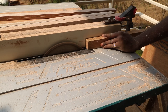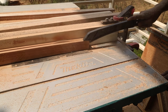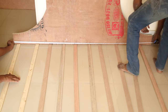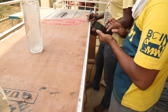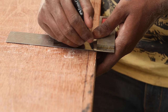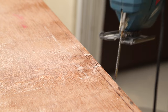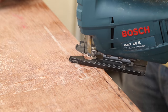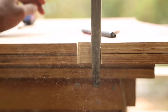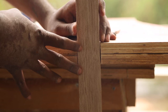Now I start ripping some strips that go between the bed legs — this will take the weight of the mattress. I lay the strips in front of the leg and measure the average spacing, then using a calculator I mark equal gaps on the entire length of the leg. Using a square I extend the mark and color where I have to make the cut. Then using a jigsaw I first make the corner cuts and then turn the jigsaw to finish the entire cut. I do a test fit to see if the cross pieces fit; if not I use a file to clean it until it fits.